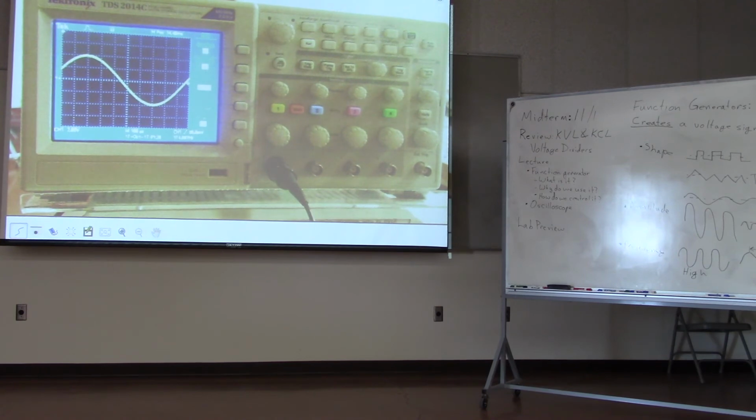The reason that I start with the squares is because I think it's important to have an intuitive understanding of how that works, so that you can just glance at a screen and estimate yourself about how big a signal is or about how fast it's moving. The oscilloscope has measurements built in that will give you a precise reading, but sometimes they can be fooled. Like if there's noise on the signal or things like that, they can be thrown off. So it's important to be able to just look at it and estimate it. But let's talk about the measurements for a minute.